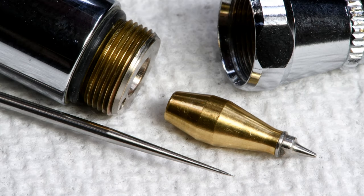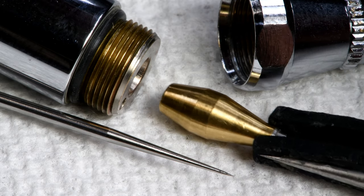I was going to close this video off, and then I thought it could well be that possibly some of the viewers didn't know what I was talking about. What I was talking about is where the brass part of the nozzle goes back up into the body. Could it be that the wire with the bristles on the end, when I was reaming it in and out, badly scratched the surface there, so that when I put those two parts together, it wasn't sealing properly? In other words, there was a little gouge or channel allowing the air.